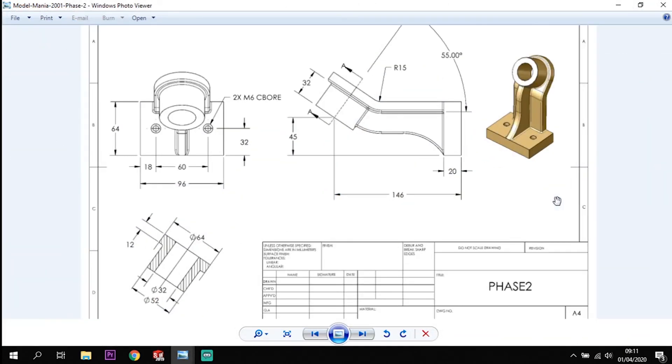On phase two there are some small differences. For instance, my angle of 45 degrees is going to change to 55 through here. My distance up from the centre is no longer going to be 64, it is now 55. That angle change will affect this offset on our rib, so we might need to do some editing there, and we'll need to edit our fillets as well. Not going to be a massive modification, so let's have a go and add these changes into our model.